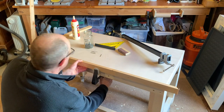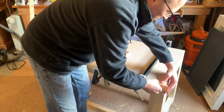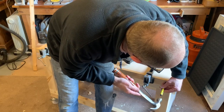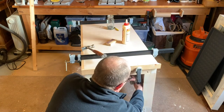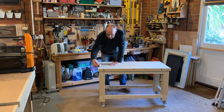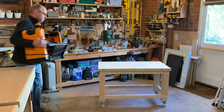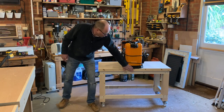I'll just quickly clamp this into place to allow me to get some nails in. I always offer up another pre-cut mitre piece - it's just a little trick I've got to make sure I get it in the right place before I nail it. I'm just going to sink these nail heads in with a nail punch. For the trial run - let's see if it fits. Perfect.